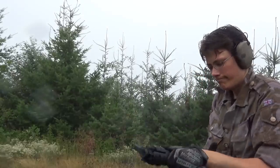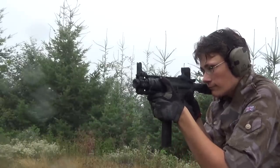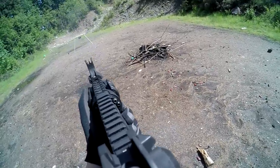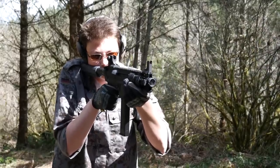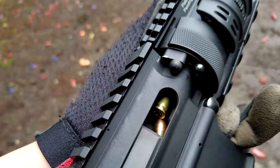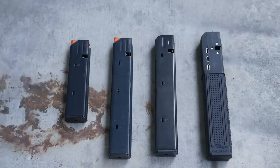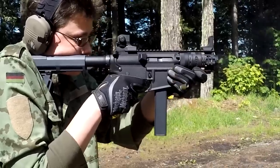This is theoretically reversible, though it's not a quick job. After getting the conversion out, I continued using this lower for standard 5.56 pistol uppers again, and it's still chugging along just fine. It is cheaper to convert a lower if you already have one, but the cost of a cheap lower plus the mag block is already getting pretty close to the cost of a dedicated lower, so I don't recommend starting a build from scratch with one of these. I had initial reliability problems, but I'm pretty sure they were tied to the buffer I was using. Once I sorted that out, the KAK magwell adapter worked pretty damn well. I mostly tested it with ASC and Metal Form mags, but it also worked pretty well with a Pro Mag metal-lined plastic mag. I put a ton of rounds through the gun with this adapter — it's definitely an option.